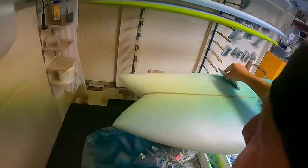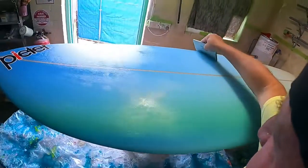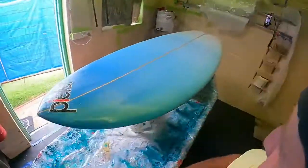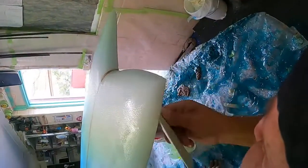I'm just checking this is all flat now, making sure there's no lumps in it. So here, you just go through there. Make sure it's sitting flat. I don't have to do this, but I prefer just to go over it once and check. Now, I'm just gonna do one lot of going around from the apex, drawing out any excess resin. You don't want the resin floating between layers on your lap. That's when it ends up resin rich and it ends up cracking. I'm pulling all the excess resin out, going towards here.